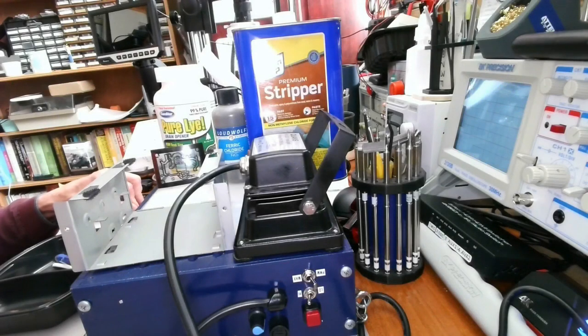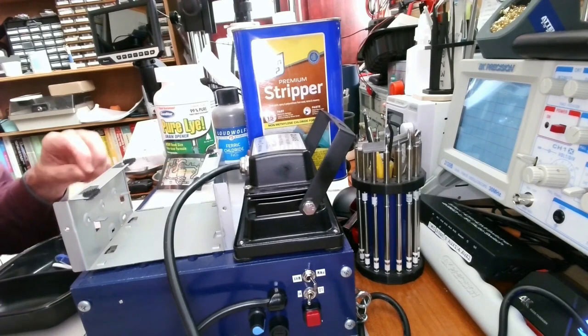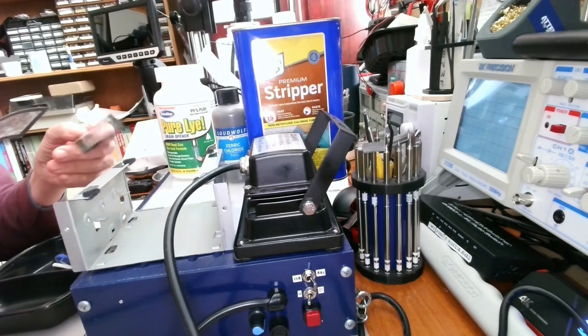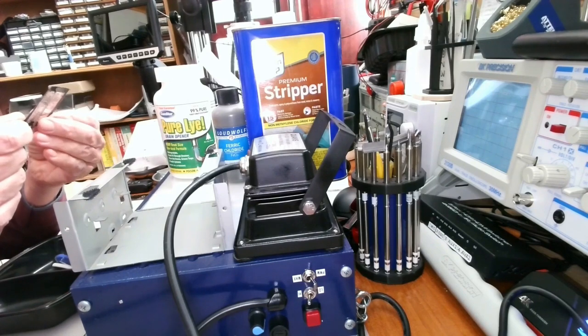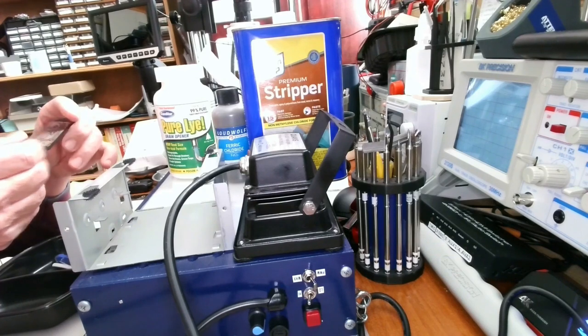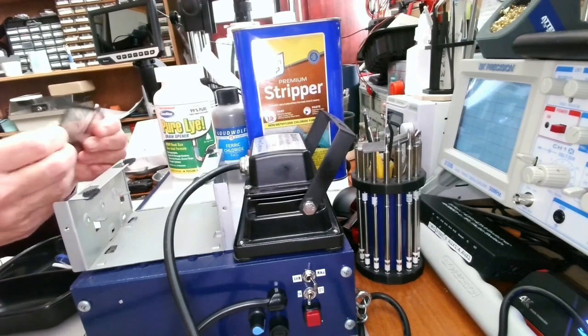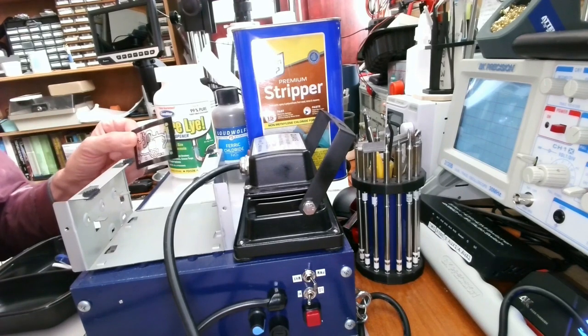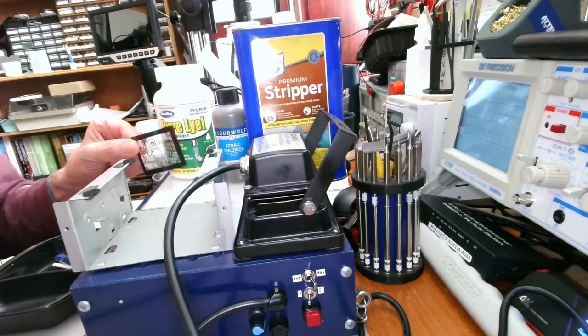All right, so I'll gather together all the chemicals and equipment that I need in order to finish our PCB. We have negatives here, and I've actually printed out two of them. I had a look at them, and my laser printer doesn't do a great job printing on this clear foil overhead projector sheets, and I've decided I'm going to use two of them and overlap them exactly and tape them together to get a blacker black, because otherwise it won't develop properly. So that's what we're going to be doing.